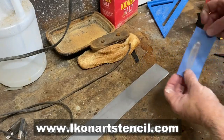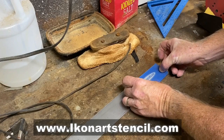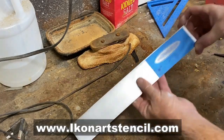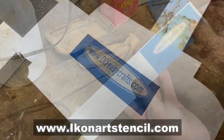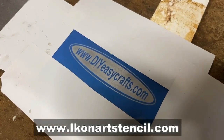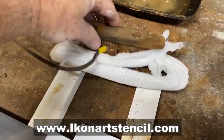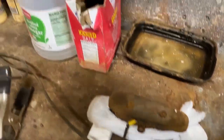I took a piece of AEBL stainless steel that I had laying in the shop. I sanded it with 320 grit paper, cleaned it off with an alcohol wipe, just to make sure that this stencil would adhere pretty well. These stencils are self-adhesive, but I did mask the whole thing in self-adhesive vinyl, really just to prevent any of the electrolyte solution from getting onto exposed steel.